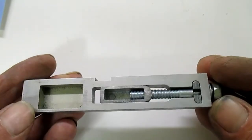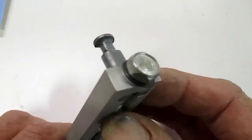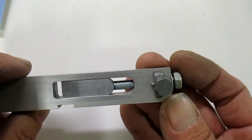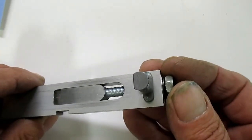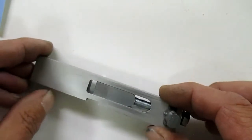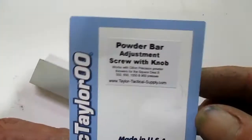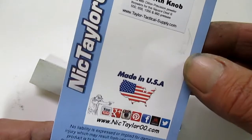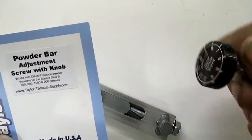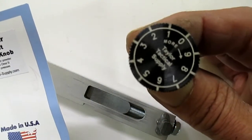I was messing around with some light loads a while back. But what this is about — and if anybody has the Dillon, you know it's a real pain in the neck to adjust with the nut on here and a wrench. Not very accurate. So not long ago I was on eBay and I found this — Nick Taylor makes this powder adjustment screw, and on it it has 10 graduations.